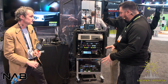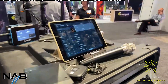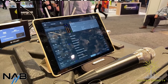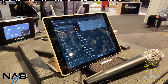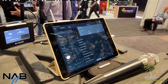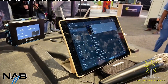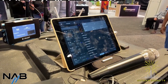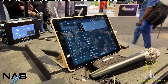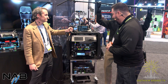In addition to all of this, we have it on Wireless Workbench, but we also have Shure Plus Channels, which is a free app on the iOS App Store. You just put a Wi-Fi router or access point on your system, and you can use this iPad or iPhone app to have great command and control. You can see just about everything Workbench can do, with the exception of frequency coordination. If you're out in the field and want great visibility, this is a great way to do it — and it costs nothing.